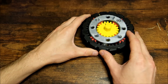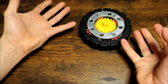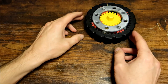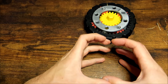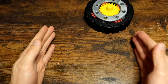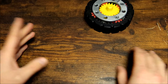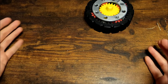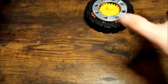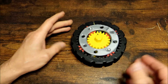The interesting thing about these planetary gear sets is we're able to get multiple gear ratios out of this and have it be in a nice, relatively compact package. Traditionally, if you're using spur gears and wanted a high gear ratio like three to one or four to one, you would use a smaller gear driving a larger gear with maybe an idler gear in between. But the more you add on, the more room you need to house everything — whereas you can take that idea and fit it into something like this, which is a lot more compact.